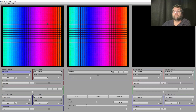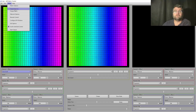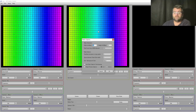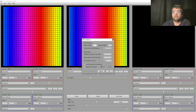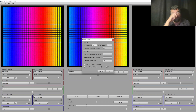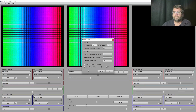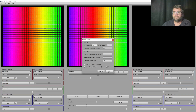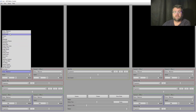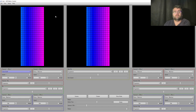I need to go and configure the light so the Jinx software knows what LED it's talking to. For setup we pretty much just work from the top down and go to Matrix Options. Like I said, I'm going to have a width of 12 — 12 lamps around the trampoline — and a height of 30, so 30 LEDs in total. That should change our layout straight away, so now we've got 12 by 30.